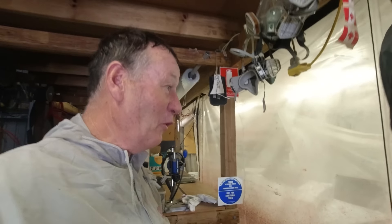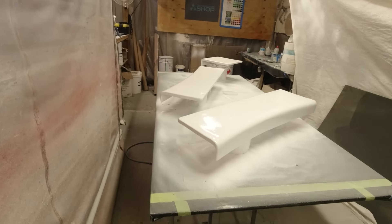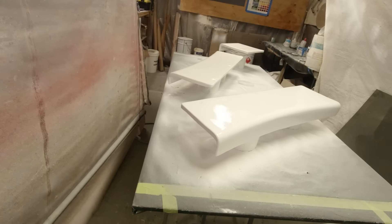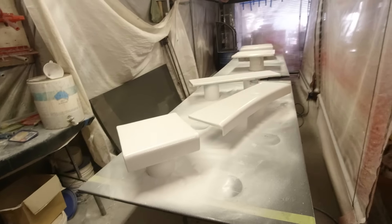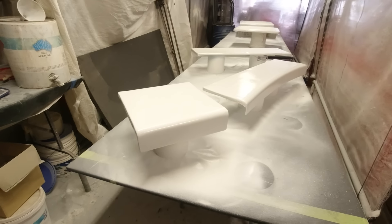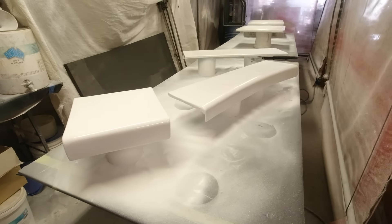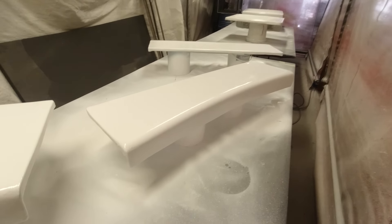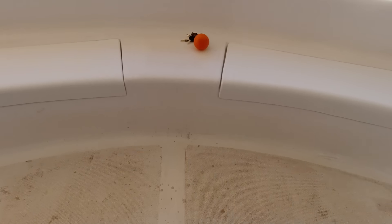It's been a big morning anyway — they're done. These guys are all sprayed up and they're looking really, really fine. Beautiful. I actually put six cups of flow coat on, so that's about 1.5 litres of flow coat on all the hatches — not on each of them but on all of them in general. I've got plenty of material on there including the gel coat before, to give this a really nice polish. These things can polish up like magic — virtually no texture on them. How much better does that look? They're perfect now.